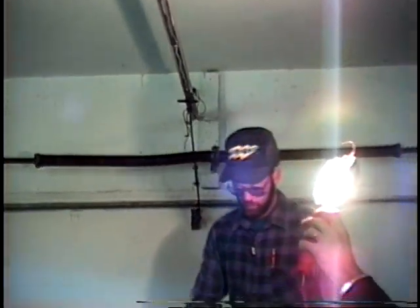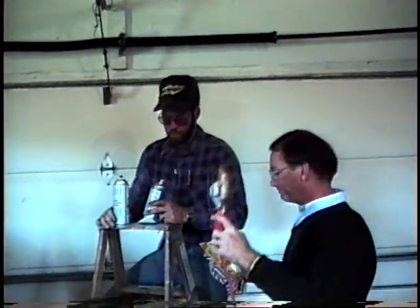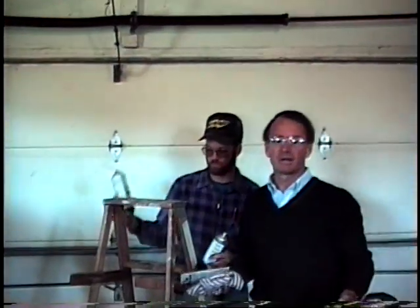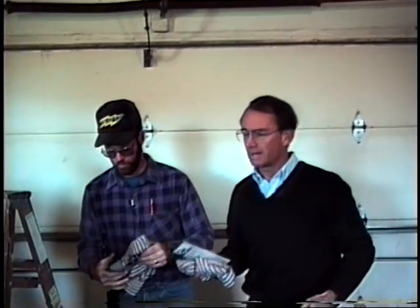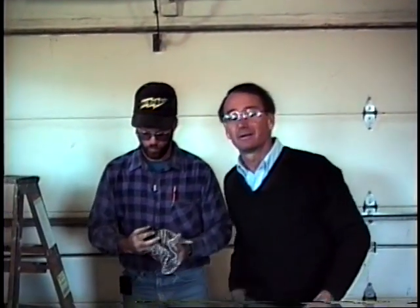Someone always comes in too, I think, Ron, one of the problems that we have, that people will come in and say, I can hardly lift my garage door. I've got to get a garage door opener. And that's not the problem. A garage door opener will not lift a garage door. The springs do the lifting, whether they're stretch springs or whether they're torsion springs. All that Genie or whatever door opener we're using is going to raise and lower it. But if the door seems too heavy, then it's the springs that are the problem, not the door opener.